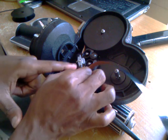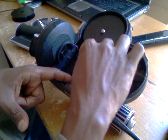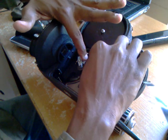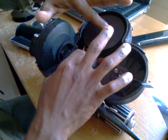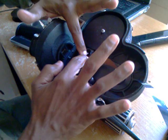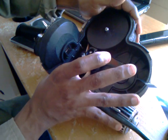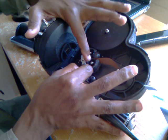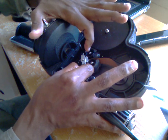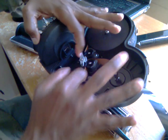You're going to take your film, once again go through that rocker underneath the bottom. There's a white guideline at the bottom there. You can pretty much follow it and it'll give you a perfect loop. Drop that down onto that sprocket. Make sure the top one's on the sprocket as well. Like that. Once you're satisfied with your film being on these two guide rollers, you can push that up and lock it. After you do that, don't just walk away. Grab your film, give it a snug. Make sure the film is located down on those perps.